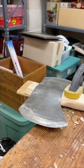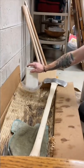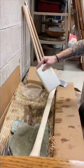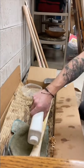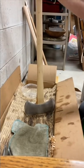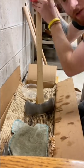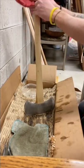Now I will cut off the wedge. The final thing to do is oil it up — I just have linseed oil here. You want to put a healthy amount because this is newly sanded, and then you take a rag and rub it in. This handle's okay. The grain orientation is so-so — some say that matters, others say it doesn't, so it depends.